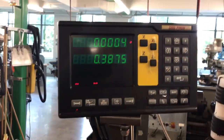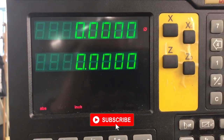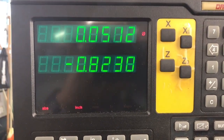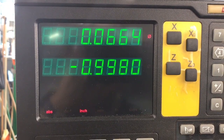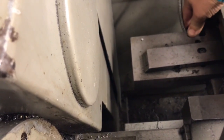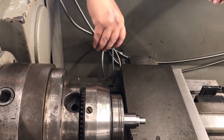We're going to rinse, wash, and repeat to double check. Move it back to where both axes are moving, zero out both axes, move an inch. My mental math was correct on the sixteenths — I want to see 62.5 thousandths. I'm at 62, but we went the wrong way and now we're at 66. So before you loosen this, move the adjustment in the opposite direction so you know which way to go when you make your small adjustment. This can take several attempts to get right — tie it back down.